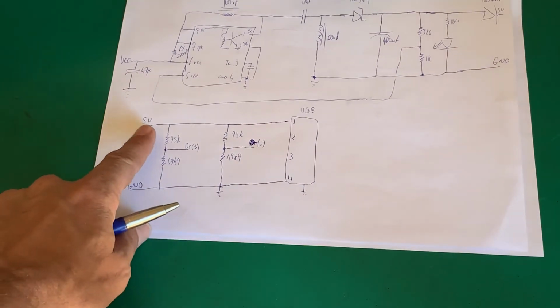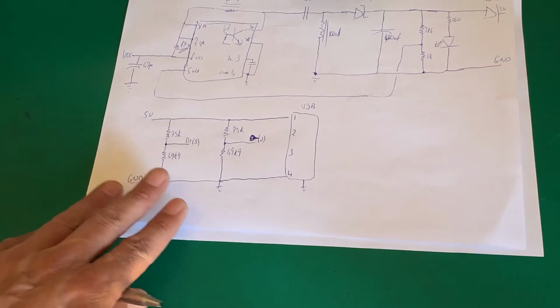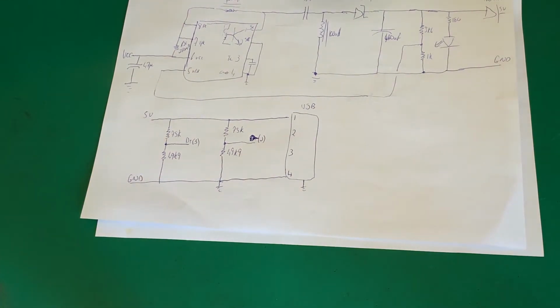Down here, this takes a bit of time to explain. So the USB standards explain to us about whether a charger can deliver 250 milliamps, 500 milliamps, 1 amp, 1.5 amp, 2 amp, 2.5 amp, and so on and so forth. And they also explain to us that the device giving the power should be able to say, I'm a dedicated charging port, in other words a DCP, or not, or I'm actually something intelligent, in other words I've plugged my phone into my computer and it's exchanging data but charging at the same time.